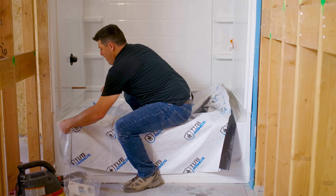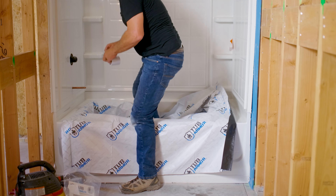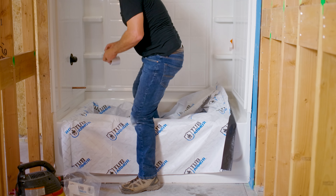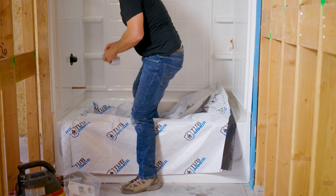These will protect the surface throughout your construction process. Step 4: Peel off roughly 8 to 10 inches of armor tape and tape the corners of the base layer while pressing down on the foam so it doesn't shift while working on the tub. You may want to use scissors or a knife to cut the tape into 3-inch squares.